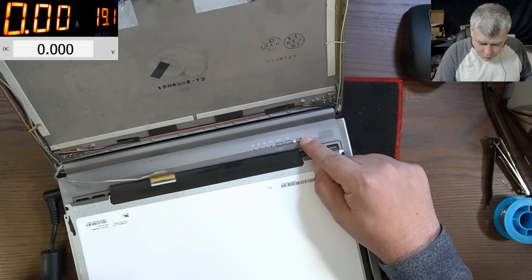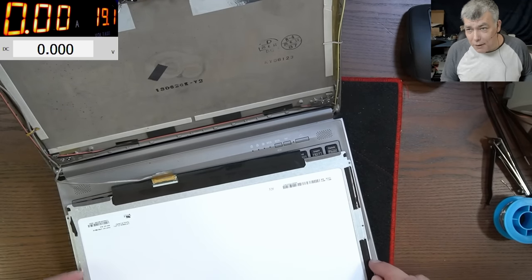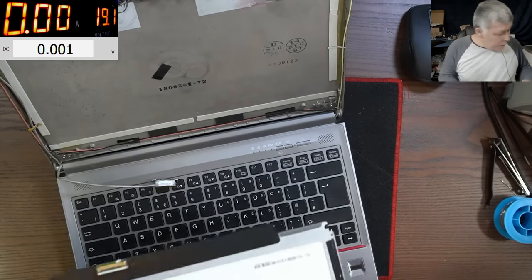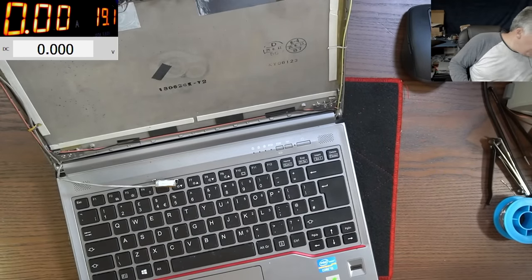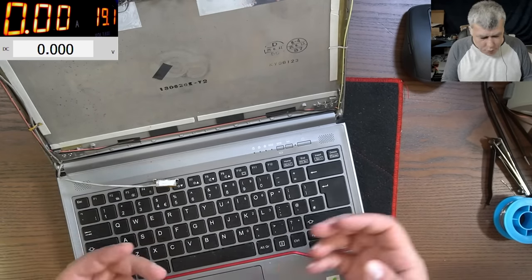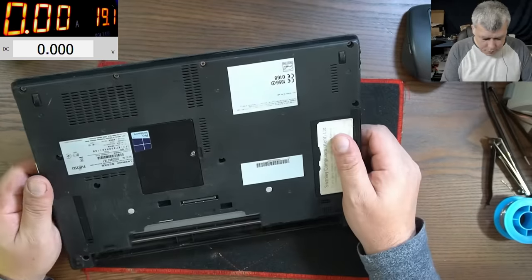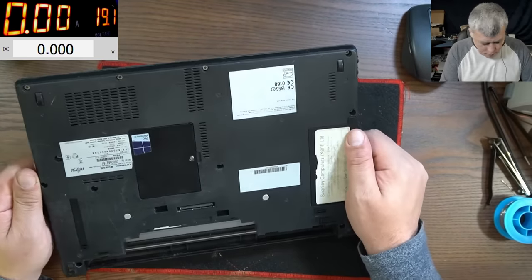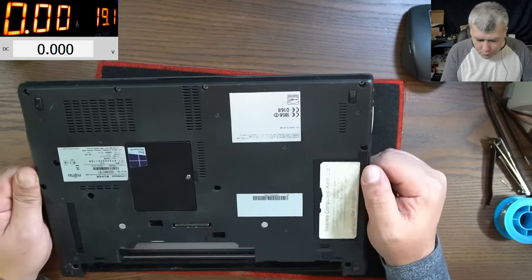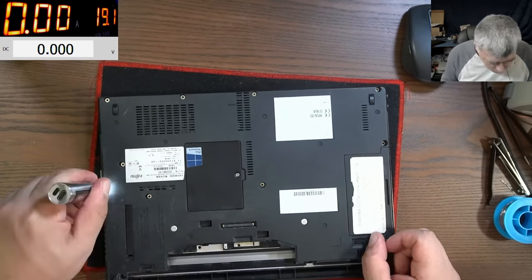So we have to open the laptop and check inside. Yeah. So see what's going on there, but it looks bad. I mean, we're both missing, I mean, 19 and 3.3. But if the customer played with the screen, swapping screens, it can happen to have a dead GPU or some things blown off the 3.3 volts power rail. I mean, it can be very, very bad.